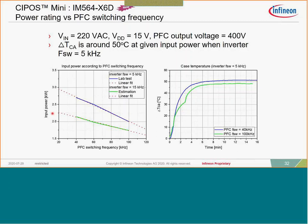Using a MOSFET for PFC, the IM564 is capable of operating at 150 kHz, though there is derating at increased PFC frequencies. Most applications in the marketplace use 60 to 80 kHz PFC frequency for MOSFET-based technology, which helps optimize the size of the magnetics. At 60 kHz switching frequency it is suitable for two kilowatts. You could theoretically use this PFC for a system with a 1.2 kW compressor drive and a 250–300 watt condenser fan, using the same bus from the PFC to power your whole system.